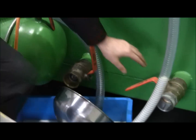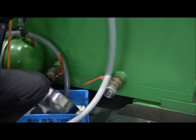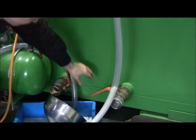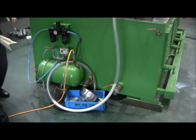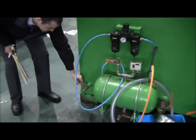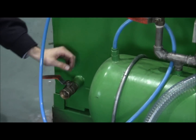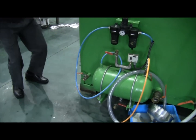These two right here — like before, you saw them on the other side — those are for water. This is for the emulsion tank. If you want to clean the emulsion tank, open these up and it'll clean it. It's on a level, so gravity will push it out on its own. Same thing with the atomizer and the entire box underneath it — to clean out the system underneath, you pop this open, it'll come out. Works through gravity, no pressure.